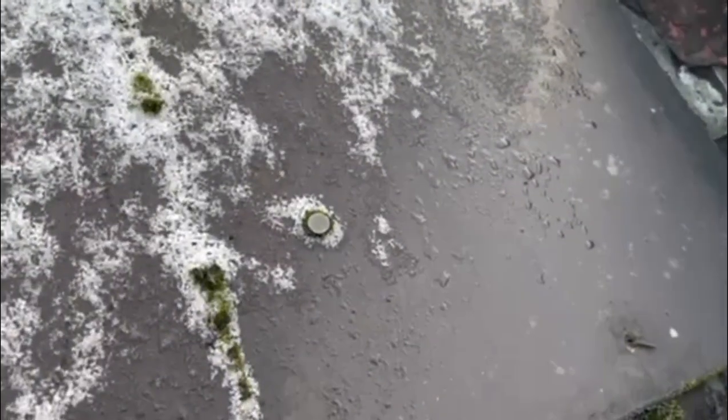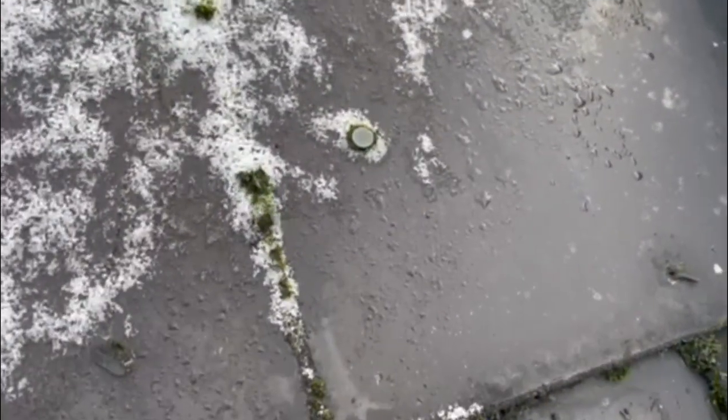On this particular roof, part of the issue is some numpties actually put nails through the slates as well. You can see there's a nail there. There's a nail there. There's one down the bottom there. So, yeah, just had some numpties working on this. We'll strip this out and make it watertight. Just taking one slate out, you can see where that was, and you can see the nails underneath here.